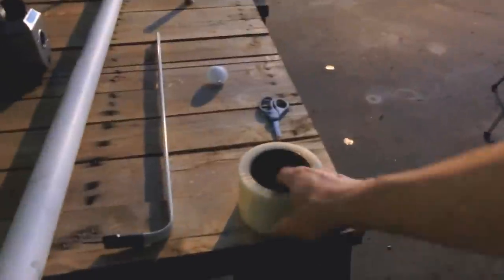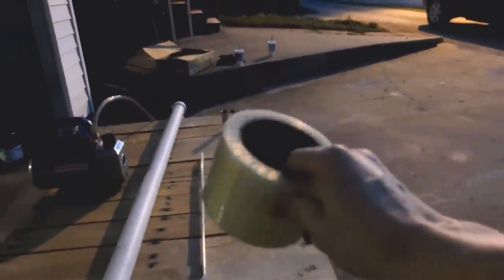In conclusion, I'm extremely happy with this vacuum cannon — it worked wonderfully and was very cheap, only about $10 in parts not counting the $80 3 CFM vacuum pump from eBay. As for the diaphragm materials: aluminum foil was okay but pretty mediocre. The cellophane packing tape was wonderful — it could hold the vacuum so you could get a full vacuum and pop it whenever you wanted, giving the cannon its full power.